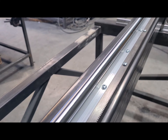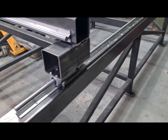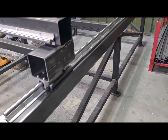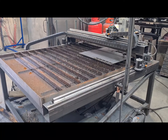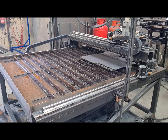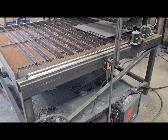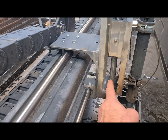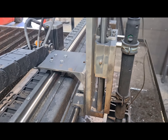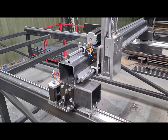I've got the X rail, SBR, and the rack all in. I braced the table like crazy - this is like the fourth road bridge, it is seriously stiff. With the little one there's a lot of judder and weird stuff going on, seemingly coming through the table legs and frame. I have noticed there is a little bit of play in this - I need to get onto the supplier about that because it's just not acceptable.